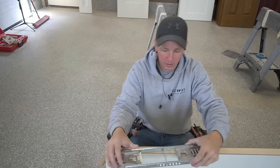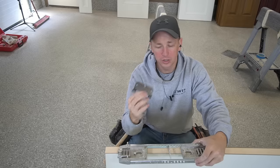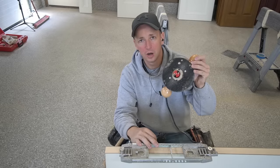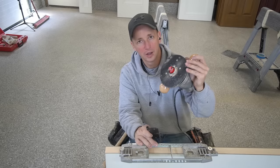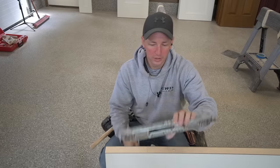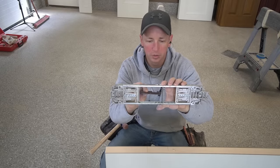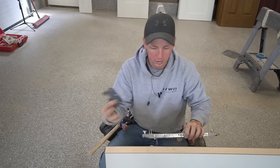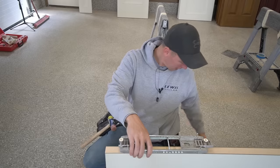The issue we have here is these hinges have a five-eighth inch radius. To achieve a five-eighth inch radius with the router bit, you need double the size of the radius — so an inch and a quarter mortising bit and an inch and three-eighths bushing on your router. The template ends up being one-eighth inch larger than your hinge: the hinge is three and a half inches and the template is three and five-eighths. So lining the template up with your pencil lines is actually kind of tricky.